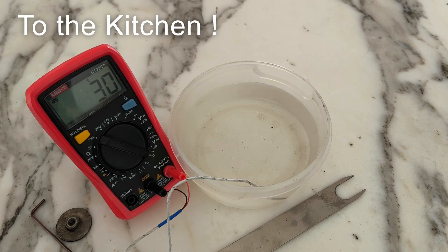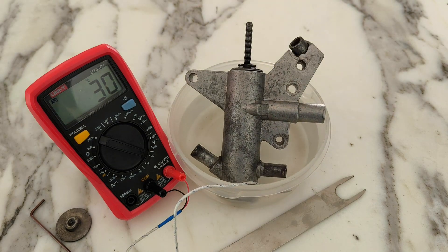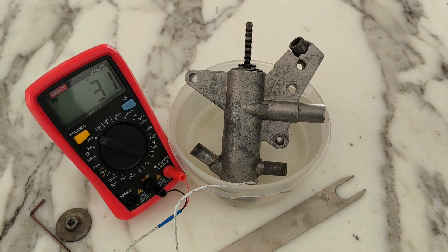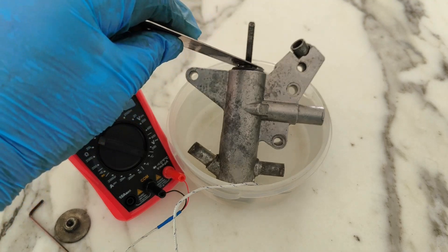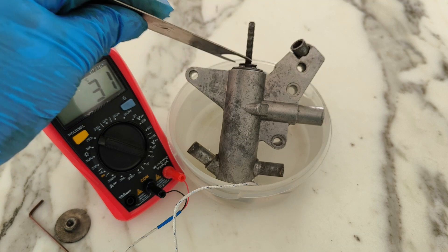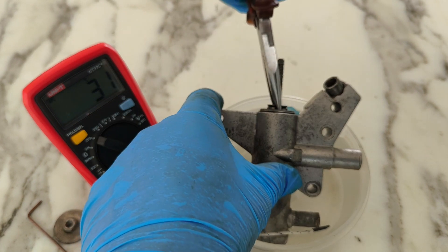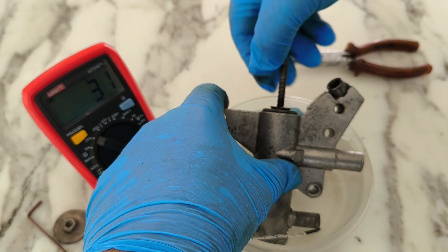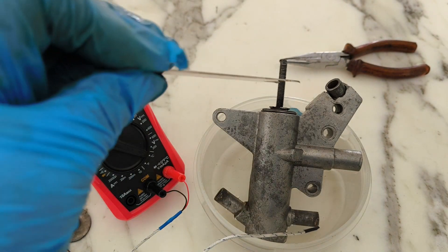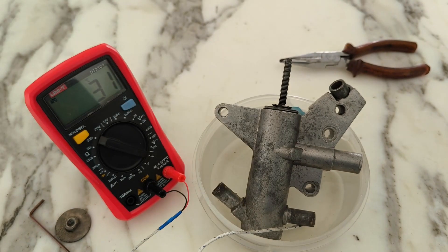Bowl of water at 30 degrees C — drop the bottom half of the actuator in, trying to make sure the water gets through the bottom part, maybe top it up a little bit. Now we need to adjust the cone so that the cone retaining plate just slides in and out level with the surface. So that's just sliding in and out and it's 31 degrees C.